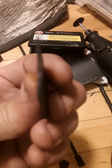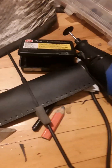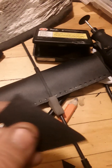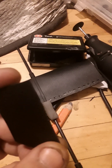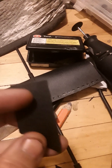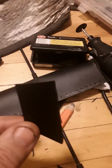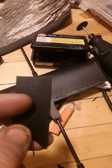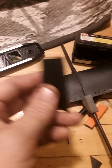That's what I've done on the other two sides already, and it means that my double thickness of this slips in there perfectly, because this is actually two pieces stuck together. I set it up, checked it for the angle, and at first I had it sitting straight and didn't like it, so I leaned it back a little bit — then leaned it back too much. If I start from here and cut straight across it's a square; if I cut from here to this corner it's a much sharper angle, so be careful of the angles. This is why I say do it in paper first.